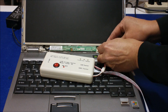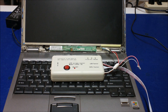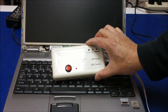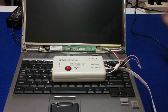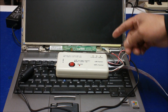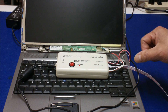When you purchase the LST01, we also suggest buying the wire adapter as an add-on item in the shopping cart. Now, because we're going to test this lamp using the CCF tester, we have to apply 12 volts. Connect 12 volts. If the lamp is good, you fire up the screen and you'll see the backlight lamp illuminate. If the lamp is bad, you don't see anything.